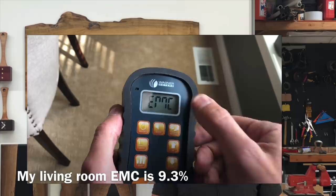How do you know the wood was dried properly for your climate? There are a few rules of thumb — I always heard six percent for Arizona and nine percent for Oregon. The cool thing about the Orion Wagner meter is it can actually tell you the equilibrium moisture content (EMC) for anywhere: you just turn a dial to EMC and it'll tell you. I go into my living room because the moisture content is different than my shop, and it varies a lot more in the garage between winter and summer. The Wagner meter will tell you the EMC for your specific area.